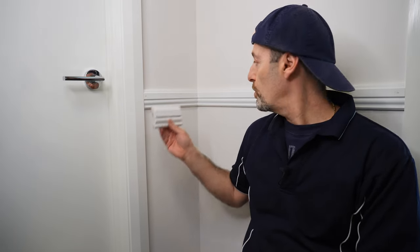Hi there, it's Geoff. In this little video I'm going to show you how to do scribe joints, and these can be used on internal corners for your skirtings on your floor, or in my case in this project I'm doing, dado rails or chair rails. Keep watching and I'm going to show you how to mark out and cut these scribe joints to get a nice perfect tight fit for internal corners.